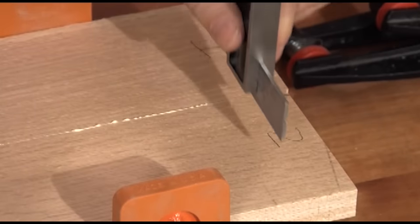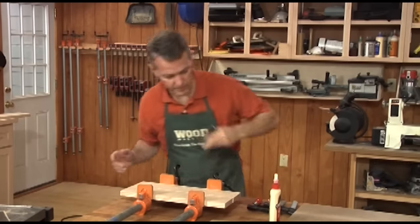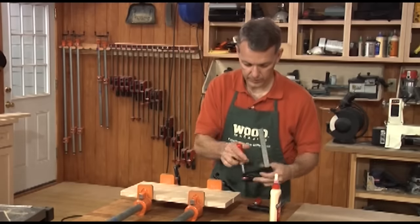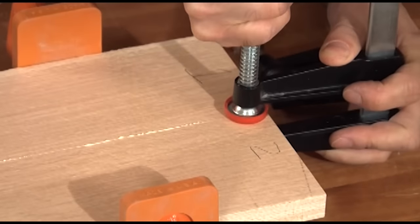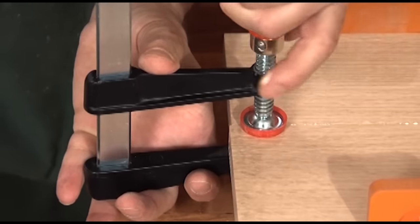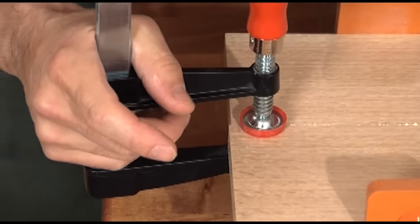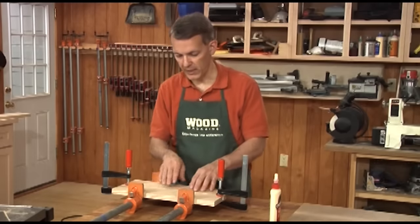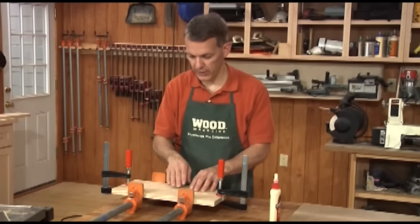Sometimes clamps will tend to force those up, but this is staying nice and flat on both ends. If by chance you're having a little trouble getting that joint line to align, just take a clamp and clamp along that joint line to bring those into alignment. That'll keep the panel a lot flusher and save you planing and surfacing after the glue dries. So that's one method for making edges for edge gluing panels — using a table saw and a nice sharp blade to get your true edges.